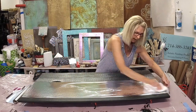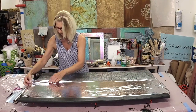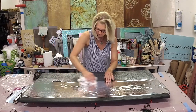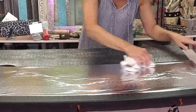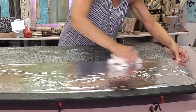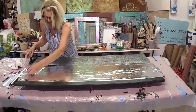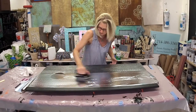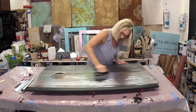Again, I always start off by rubbing with a terry rag, especially in the area where I've overlapped. I've overlapped about an inch, which gives me an area where I can transition. I like to transition with a rag because if you come in with your scrubber brush you're trying to scrub foil over an area that's already transferred with foil, and you could actually scratch it. Just work along that edge so the seam comes together without any issue.